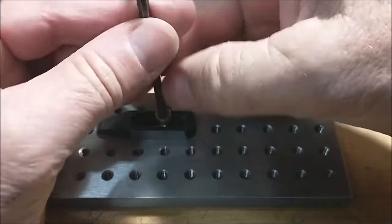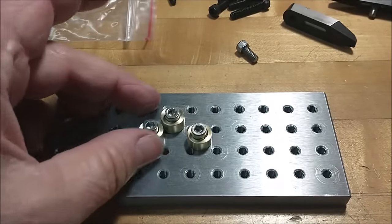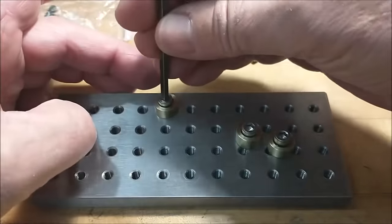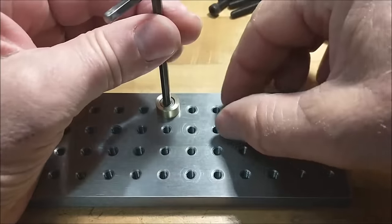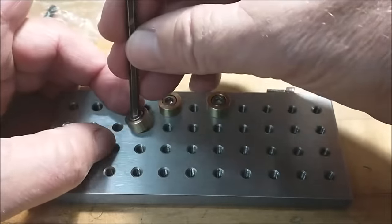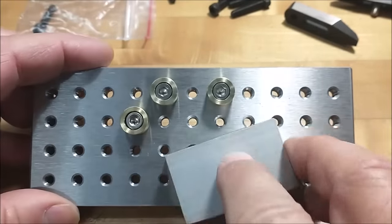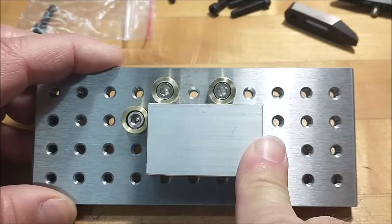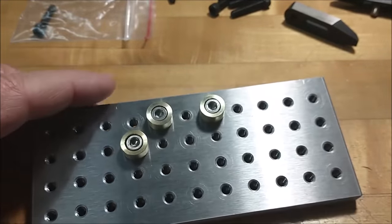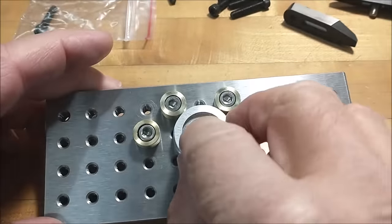For my kit I've also made some brass buttons — little cylindrical pieces with counterbored screws in them. Let's put two in here. Now you have a repeatable setup for small square parts, and you can do the same thing with two of these for your round parts. I hope the lights are showing you a little bit of versatility for what you've got.